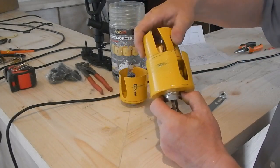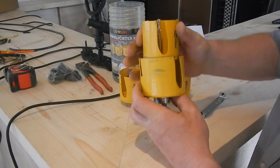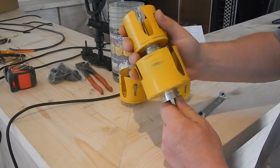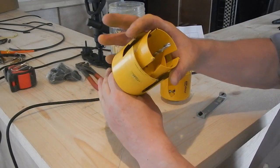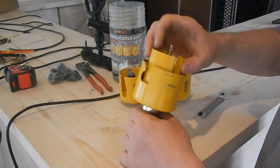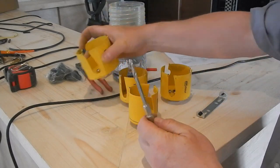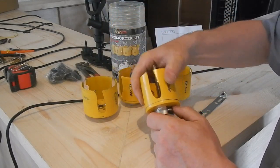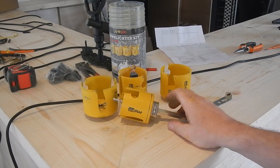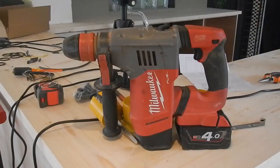And therefore, it allows you to center the arbor with greater ease. So I can expand out to, what's that, diameter 80 millimeter from a diameter 64 millimeter hole. Today, I'm going to be using the smaller of these because it's just to get a cable out from the ceiling for that multiple light holder that I've showed you before. And I'm going to take the feed from the lights that are already there, so the switching.